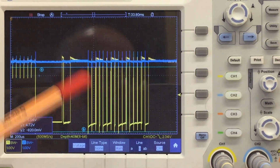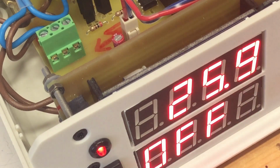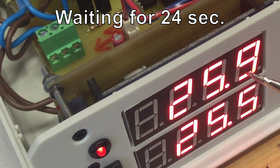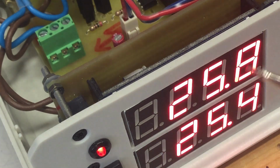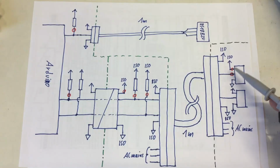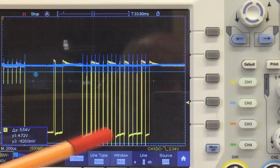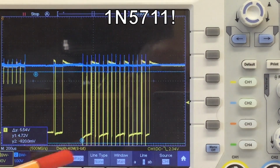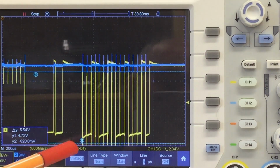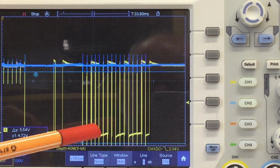And yes, the glitches are back. If you don't believe me, we just have to wait a second or so. There, glitch. Okay, we had to wait 5 seconds or so, but yeah, it's glitching. It's noticeably glitching. Haven't moved the probes, still here at the sensor. Nope, the BAT48 radio frequency Schottky diode does an even worse job. So you see almost all spikes are touching the -1 volt line again, and maybe are even going beyond it.